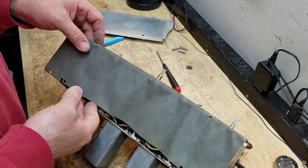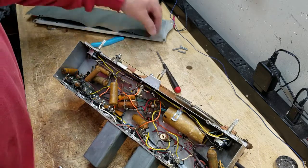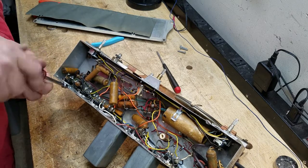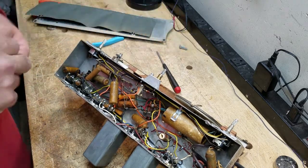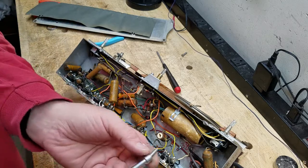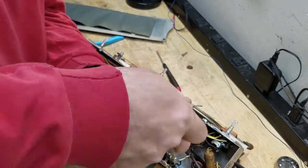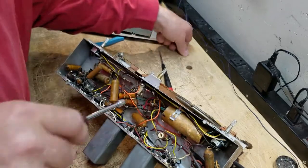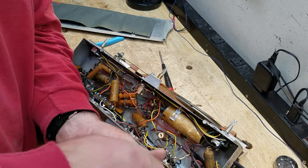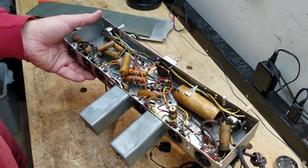All right, this frame is off of there. This little insulating pad — I might make a new one, but this one maybe is okay. It looks untouched, and I'm real happy about that. I'll go ahead and put these screws back in too, because I don't want to lose track of them. This big electrolytic looks like it's got three caps in that one capsule, so I'll probably be putting three electrolytics in here. A whole bunch of waxies — Radio TV Phono Nut calls them waxies, and I kind of like that. Nothing to it — this should be a simple chassis to do.